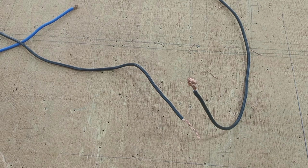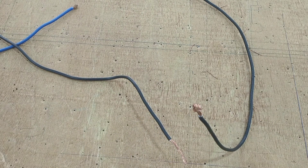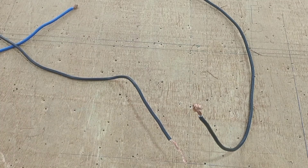Because the joint can easily break, it is likely that in the course of using this cable, the resistance at the joint will increase. When the resistance at the joint increases, the increase in resistance will cause heat to be generated at the joint. This heat will increase your electrical energy consumption even though it is not being used for anything. If the resistance at a joint continues to increase, that can also lead to fire, which can cause great harm to your property. So it is very important to pay attention to electrical joints whenever you are doing your electrical wiring.